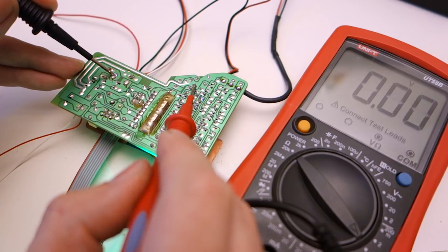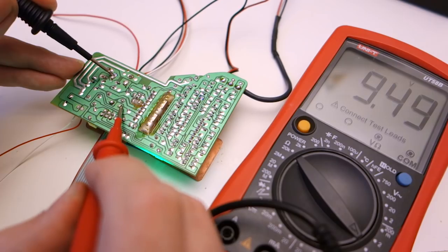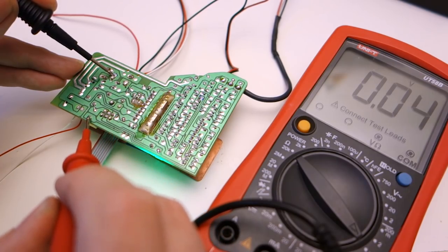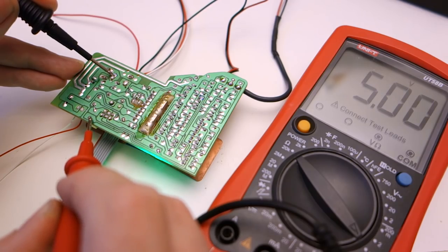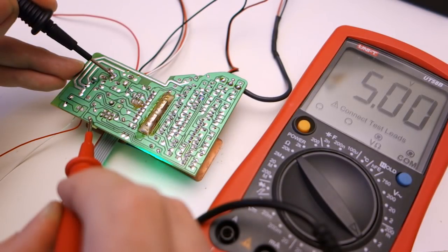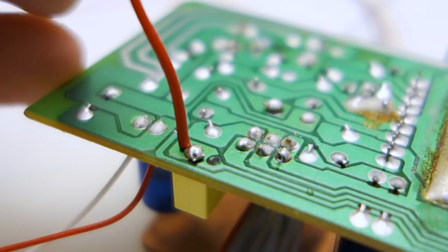The issue is though that we don't have a USB connection in our build, but that's easily rectified. Using a multimeter, find a point in between ground and anywhere else which has steady 5V power. Likely you're going to find one. Alternately, you can use a DC to DC converter directly from the power jack to step down the voltage to the 5V required for the USB. Connect these 2 points to power and ground of a female USB jack.